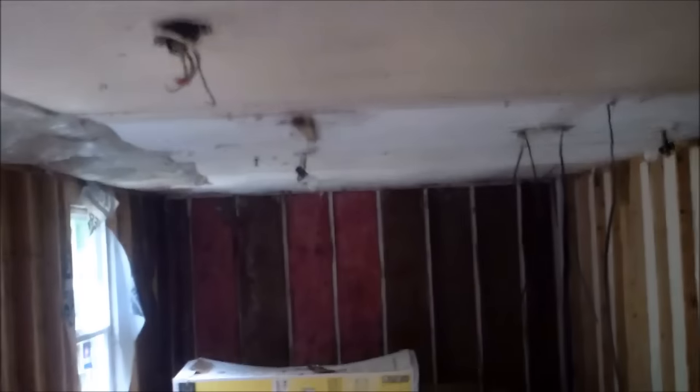Today's goal is to do a lot of cleanup and also to move those bathtubs into another room and start framing out that first room's closet. I didn't get two walls framed today — I got one, but I'm happy with that. A lot of cleanup still to do. Gonna have to replace this floor before I build a wall. I went ahead and cut the roof out right there and screwed pieces of wood this way to tie into the stringers so the wall can't go anywhere. That wall will have the closet shelves, so it needs to be strong.